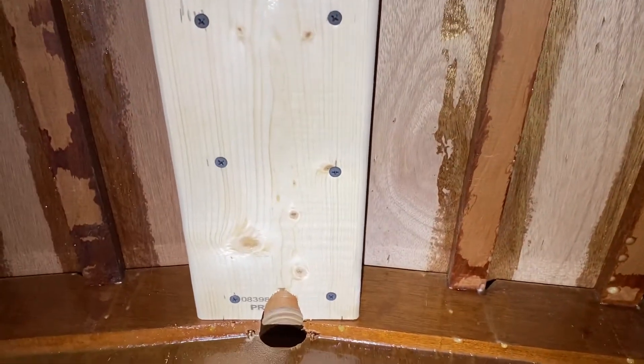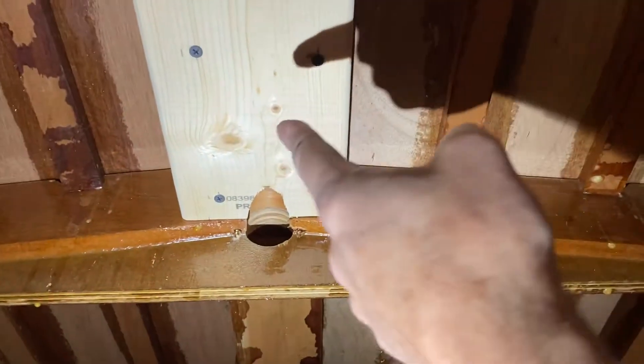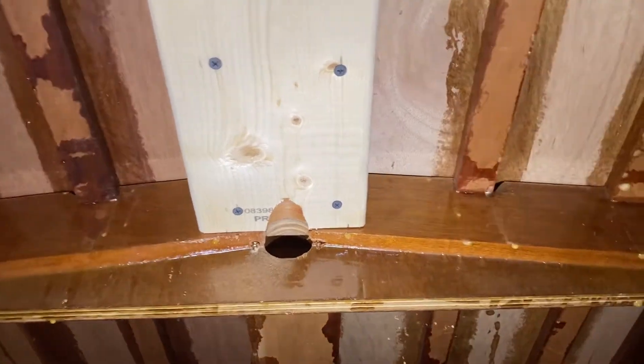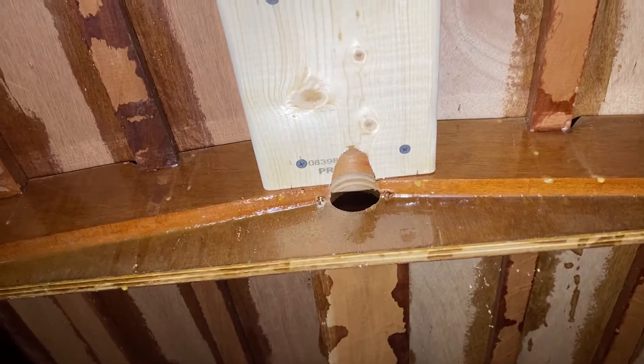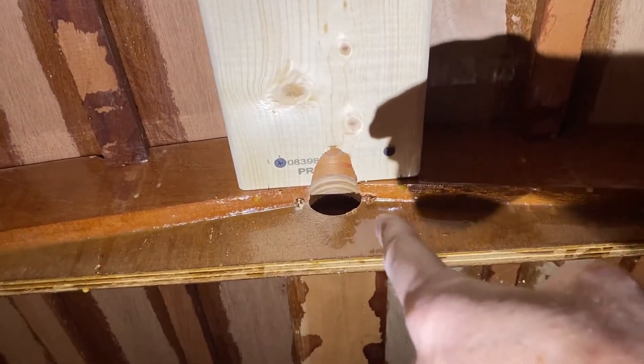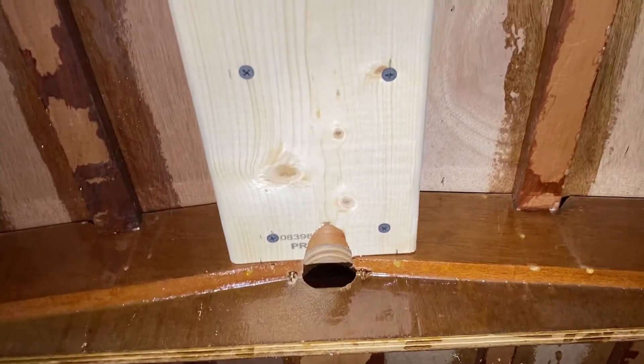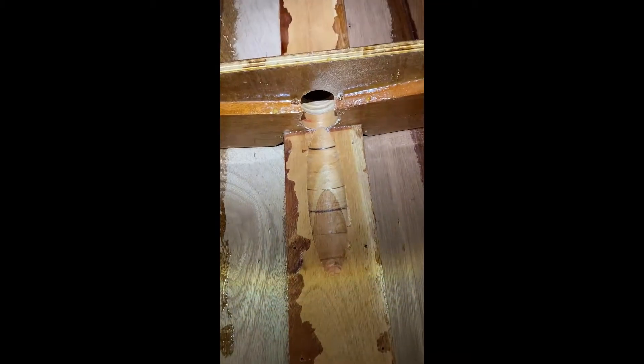I just finished with the prop shaft hole - this is an exciting occasion for me. I'm underneath here and you can see it came through nicely. I'm going to take this blocking off in a minute - you can see where it came through and then went right on through frame number two. One thing to note: when I drove screws for the keel in frame two, I wasn't thinking about spacing relative to the prop shaft hole, so I hit the screws just a little bit, but it powered through just fine. Here's what it looks like now with that blocking piece taken off - nice and clean, and it actually looks centered too, which is great.